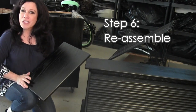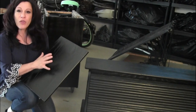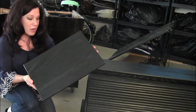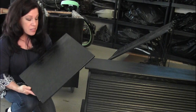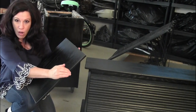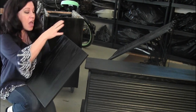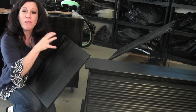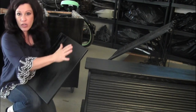It's 24 hours later and I'm ready for step six — reassembling the furniture. Before I do, I wanted to show you the beautiful, flawless finish created with spray paint. If you take your time and don't rush the process, by starting off the project, spraying across, and finishing off the project you get a beautiful flawless finish. Spraying in one direction and then turning to spray in the adjacent direction ensures a beautiful, even coat over the entire surface.